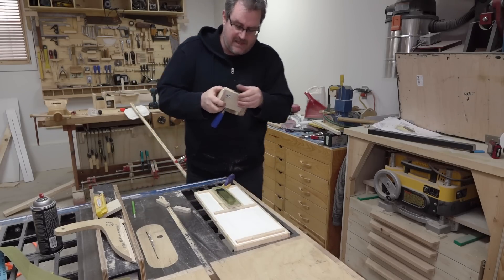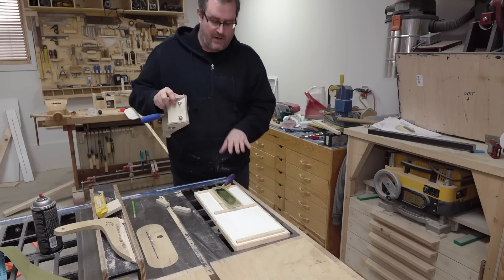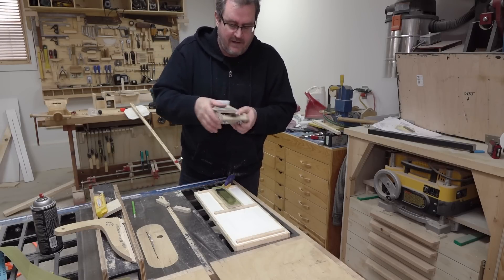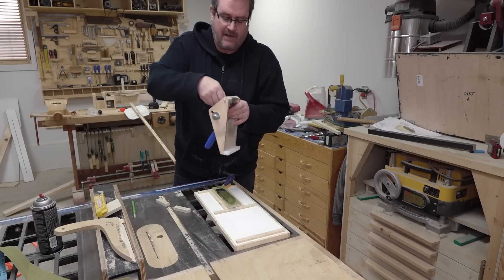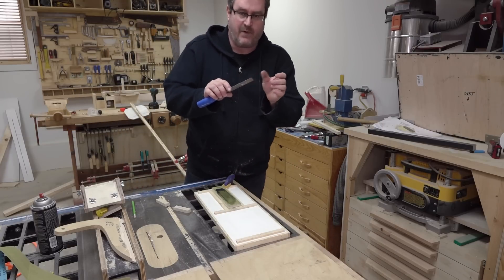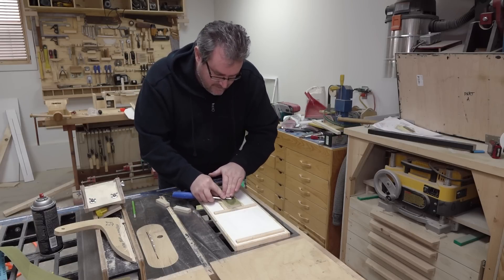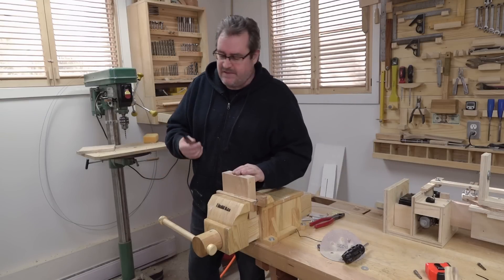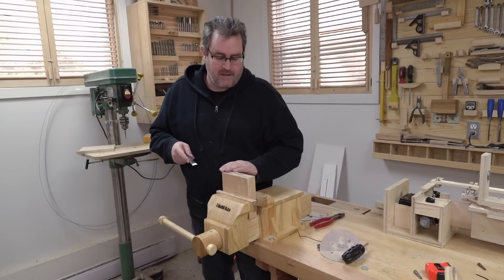It didn't take long — maybe a minute all told to grind right across. This is 400 grit, and I know there are a lot of guys that like to go way finer than that — obviously you can, that's a personal choice. I'm going to stop here, take it out of the jig, and quickly get rid of the burr that I've raised on the other side by laying it flat on the stone and going forward like that. I've got a piece of hard maple in the vise — we'll try it out and see how sharp this is.